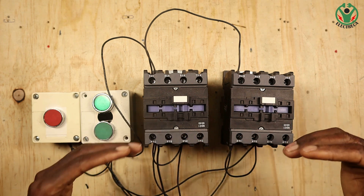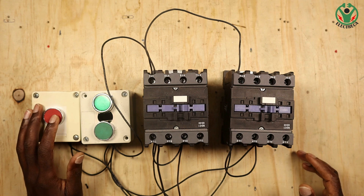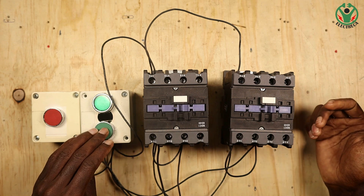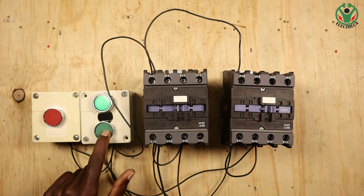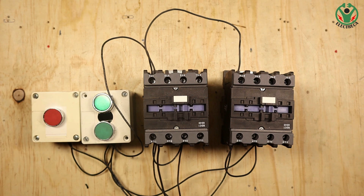It's a protection feature, a safety feature. Instead, when we have that mechanism in place, we will prevent this contactor from coming in. Imagine this is a motor running in forward, and you're running it as a forward and reverse starter - it might be a conveyor belt. You press forward and then press reverse and reverse also engages - you can imagine how bad that is.